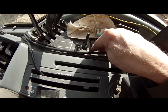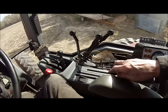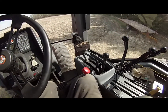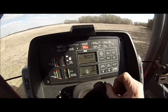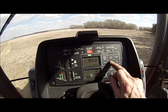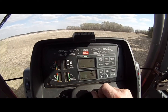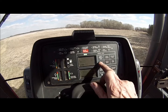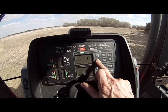This is supposed to adjust the flow here but the cable is seized up, so I have to get out and use a half-inch wrench to adjust it under the cab. I also have to set up the monitor for counting acres, since the counter on the seeder doesn't work. I've been using this for several years and it's pretty accurate.